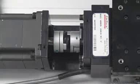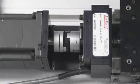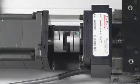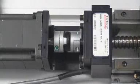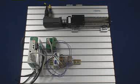The slide will perform the homing routine on power-up. This particular routine will lower the torque and retract the carriage until it hits the hard stop. After the hard stop is established, the motor will reverse until the Z or zero pulse on the encoder is found. This point becomes the home or zero point for the motion.